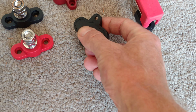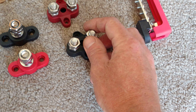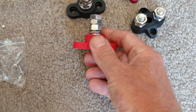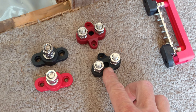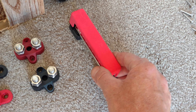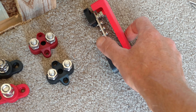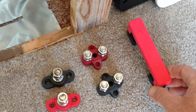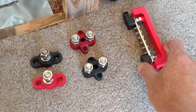So these are going to be low-amp connections for things. These posts are fine — I can just double up on those. I think I need to get two more bus bars that are high-amp and will take 400 or 500 amps. There's my positive bar here for my low-amp positive stuff that'll come off for other things I want — DC things like little fans. But everything will be off fuses first, so they're fused before connecting. I may not even need this, so we'll see.